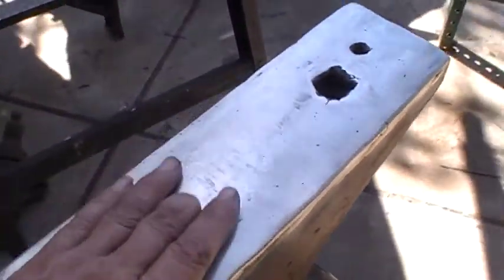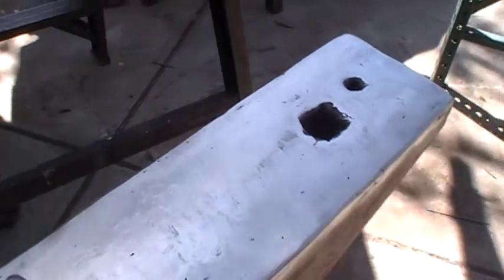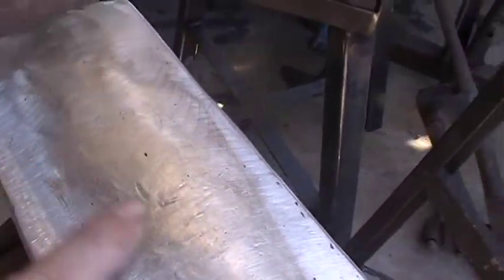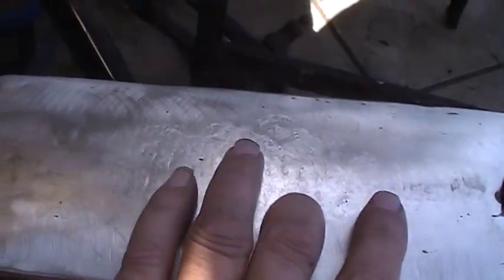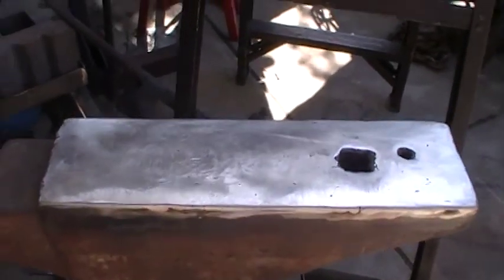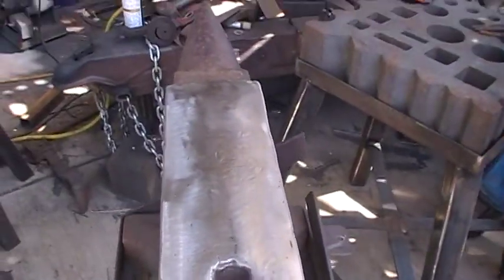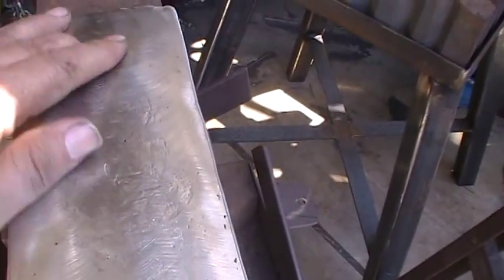This is an anvil I was working on — I finished it up and I've been using it. Now this is stainless, probably not the best material to use on an anvil face, and it does dent up a little bit. Stainless steel is softer than mild steel but it's tougher than mild steel, and it will work-harden unlike mild steel. The more you work it the harder it gets, and it can literally get glass-hard. When it gets that hard it's called embrittled, and at that point it just kind of shatters. I'm still going to use this thing, and if I have to I'll face it over with a different material — maybe 70-18, I've got some hard-face rod.